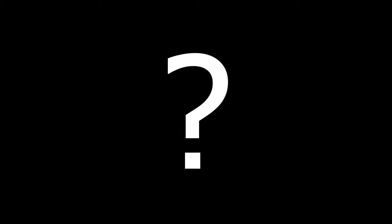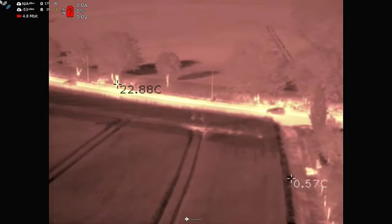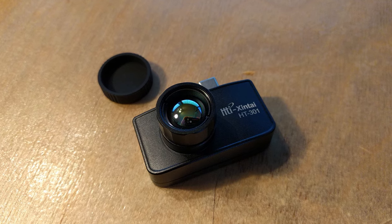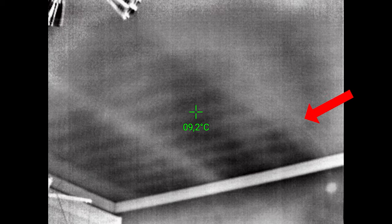And what is this second camera, you ask? The second camera is a thermal camera. Because what is better than a thermal camera? A flying thermal camera, obviously. This thermal camera is the HT301 from Xyntai. It has a resolution of 384x288 pixels and a frame rate of 25 fps. It has a real germanium lens for an undistorted image and a sensitivity of 0.06 degrees Celsius. For example, you can easily see footprints on the floor after a person walked over it three minutes earlier. You can even see the cable of a ceiling lamp coming from the distribution box because the cable gets slightly warmer when current passes through. The beams of the ceiling are also visible because of heat bridges. With these properties, it is possible to identify an animal within 200 meters and detect movement even half a kilometer away.